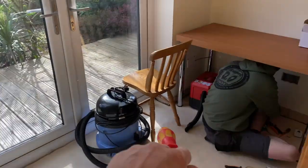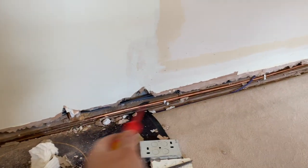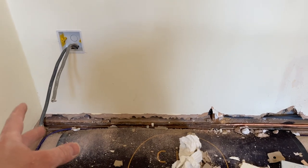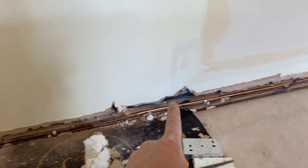James is continuing to swap the sockets. I've managed to get my socket down inside the wall. This isn't a cavity wall as such, so I'm happy to use plasterboard boxes. I've pulled my feed back here, wired down to that one and back up to that one, saving cable. The cables run behind the skirting board - that was the only accessible route. The client knows and is actually putting the skirting board on himself. I'll put a note on the minor works test sheet to say the cables run behind the skirting board.